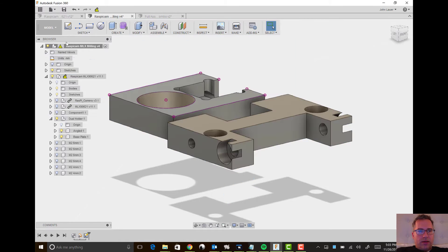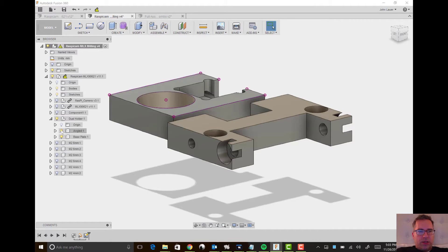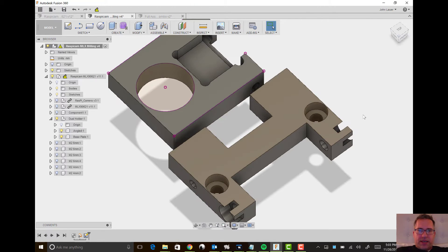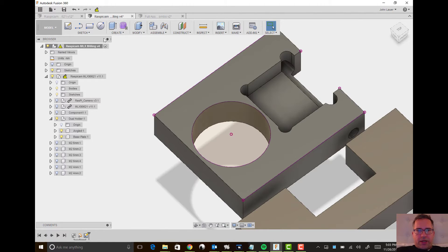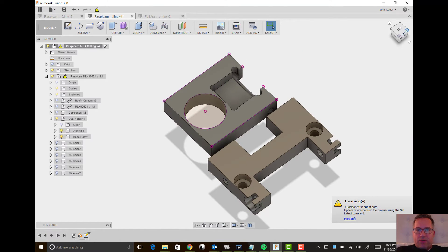You can turn off a lot of components — for instance, I have the actual camera board turned off and the heat sensor turned off — and you take the actual acrylic pieces and rotate them to lay them flat. The reason this is really cool is that if you change the design, for instance I had to go back and add these little jut-out areas to get perfectly square corners — otherwise you'd end up with a little inner fillet. You go back to the original design, adjust it there, and then when you come back it's perfectly laid out flat and ready for your milling job.